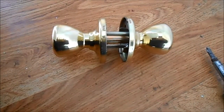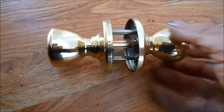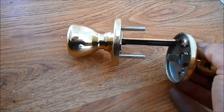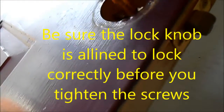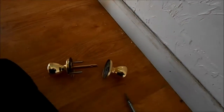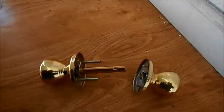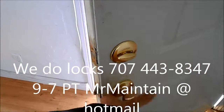Just before you put your doorknob portion on, you want to line them up and get them flush, then take them apart exactly the way they came off and install them that way. That way you know how they're going to go on there — that's the trick. You want to make sure you know how they go together first before you try to put them together on the door. Things look smooth here and the action seems to be fine.